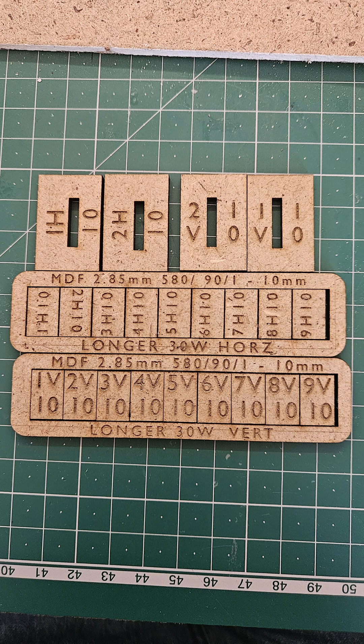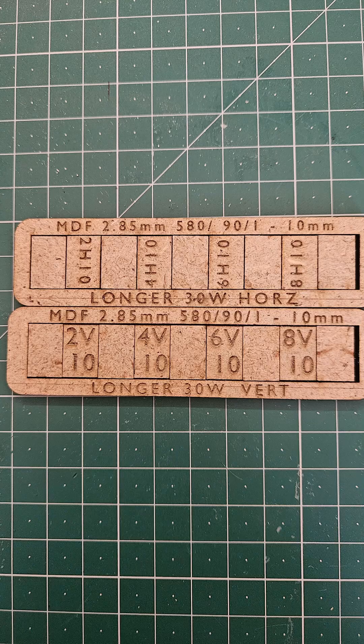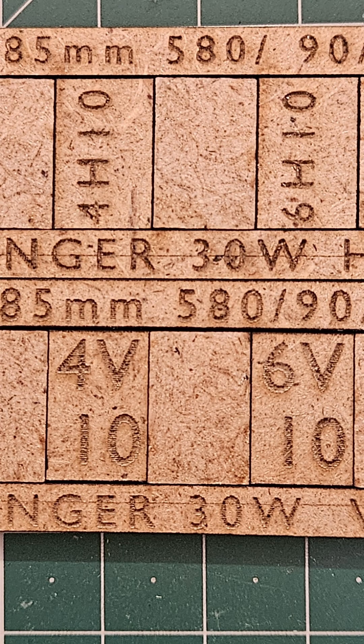What concerns me — and it was alarming — is that once I turn the pieces over, you can see the slots become thinner. That highlights the problem: my laser is not perpendicular to the workpiece, so instead of getting a nice through cut, it's cutting at an angle.